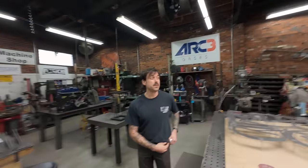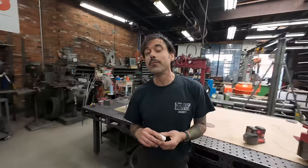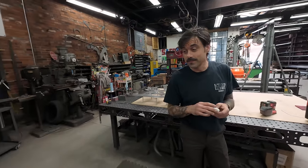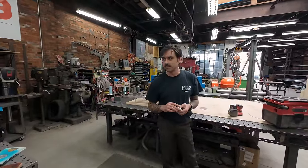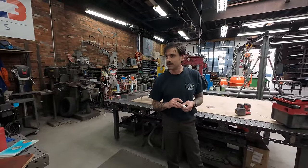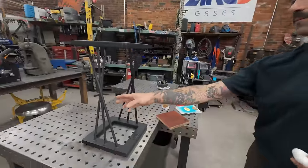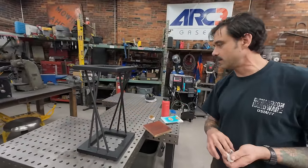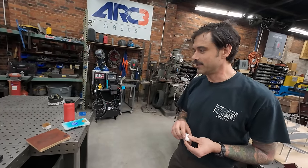The red and black — so people are like, why was it red and why was it black? It's because we didn't have primer and I used a paint-primer combo that happened to be red. And on something like this, that's nice because it acts as a guide coat. When you're painting steel with mill scale on it matte black, it's hard to make sure you got all the areas. But if you get it all red first, then you're sure you got full coverage.